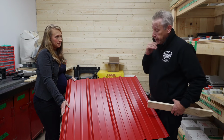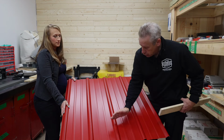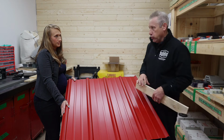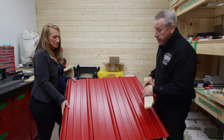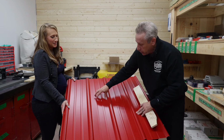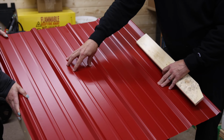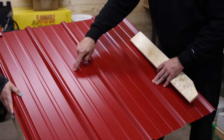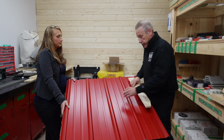Or if you're in, again, Western Canada, Eastern Canada, extreme snow, certain parts of Quebec, snow will back up on the roof, and it's tougher on a 9/12, it's going to come up pretty quick. It sheds pretty quick, absolutely, but on some of them it can back up. And if it does back up, it's not water, but the snow will melt, and now the snow is sitting on top of the fastener the entire time. You've got a leak point potential there that we'd prefer to have in the rib than in the flat. Having said that, if you want the flats, no problem.